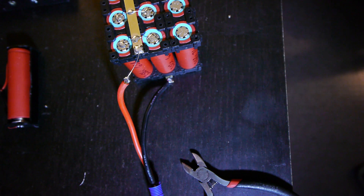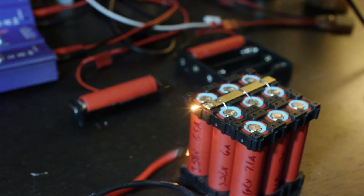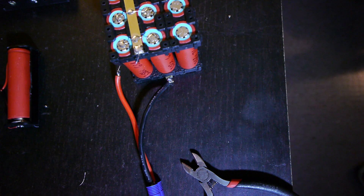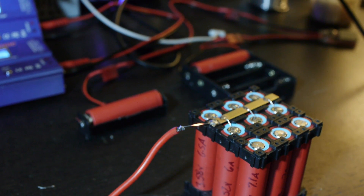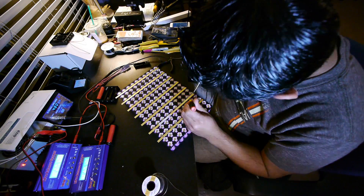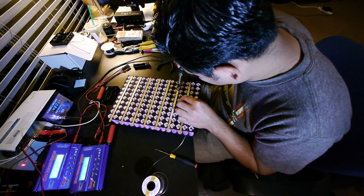Let's try 6 amps. This is the first little cable that I tried. The current climbs — 1.7, 1.7 amps — and boom! It blows. That was at 6 or 7 amps. So if one of those batteries in a big giant module happens to go wrong and shorts out, that little fuse wire will just be done. It looks like I have found my fuse cable — it blows at 6 amps. If I want it to blow at higher amps, I could just double it up and then it'll be around 12 amps.